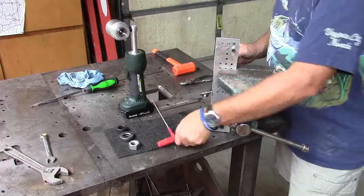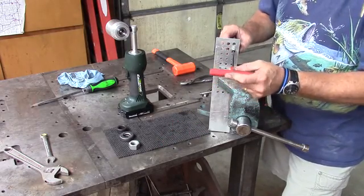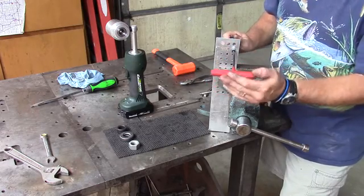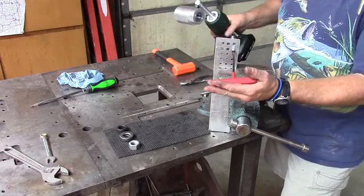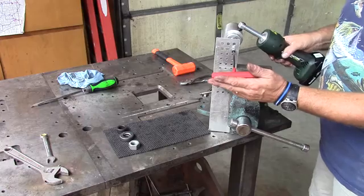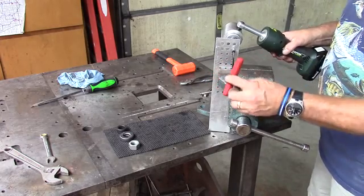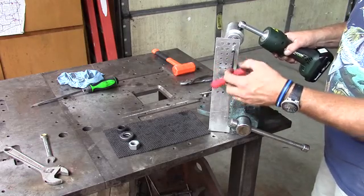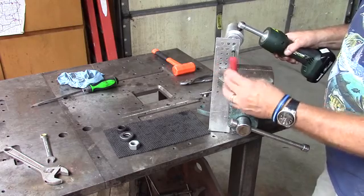Now, this is going to have some further use. We leave it in place, and we can control the alignment of that flat by orienting our Allen wrench. And now we're going to take our Greenlee, and it's also going to help us when we thread our Greenlee on. I can hold it just like this and thread the whole die, adapters, base, center bolt, everything in with my Allen wrench. Very nice. Got quite a ways to go here.